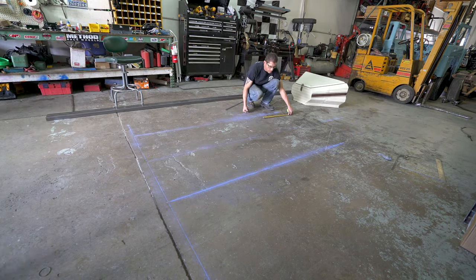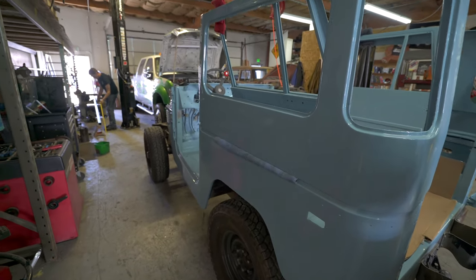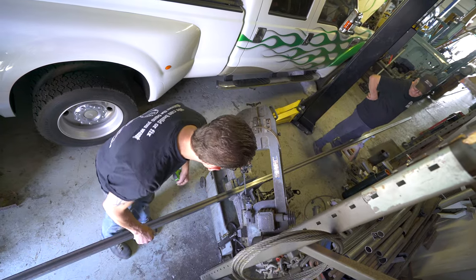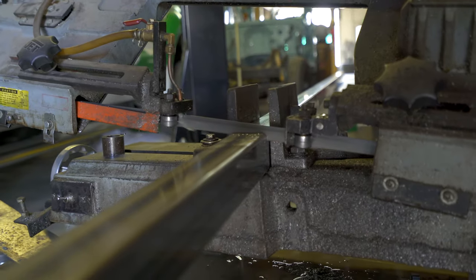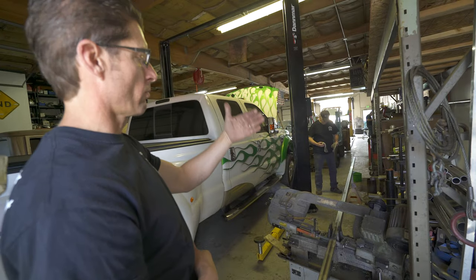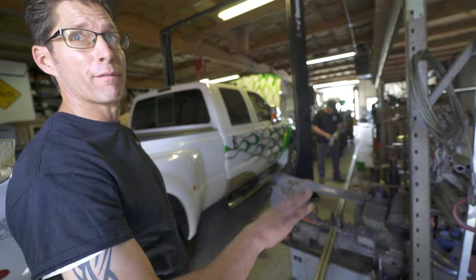After lunch we spent some more time getting the lines and measurements dialed, then it was time to head back and cut some sticks. We're 75 on the long side. The faster you cut them, they're just not as consistent — the blade can bow a little bit and walk. If you cut slower, you get a really nice clean edge. You don't have to do much grinding when you're done either — very little. Just deburr with a file, wipe it off, and burn it.